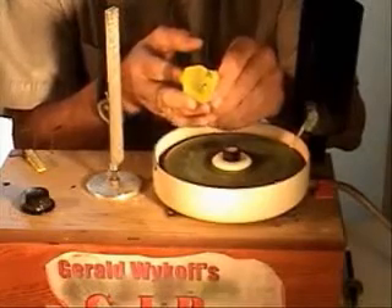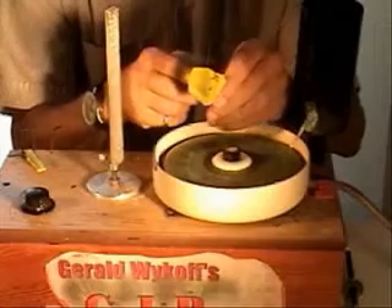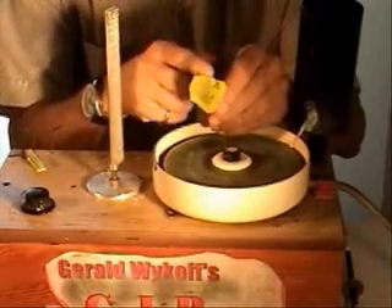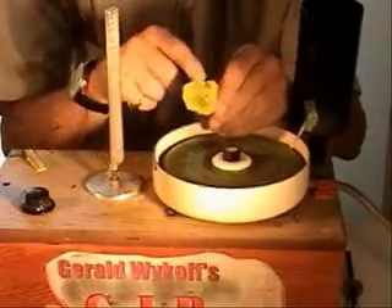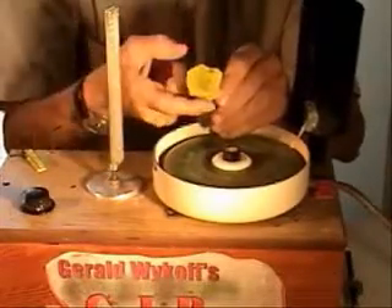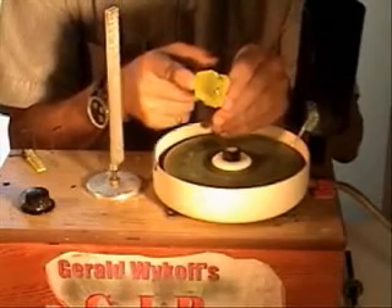The Florentine is a nine-sided stone, so I had to make up a special index gear with 54 addresses so that I could divide nine into 54. Every sixth position on the index wheel would cut one of the sides, and then I could drop in the supporting facets.